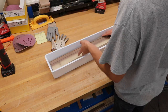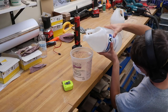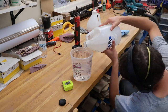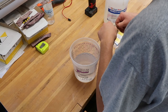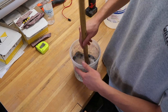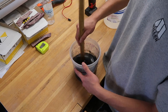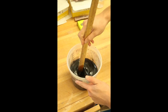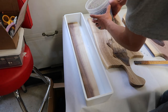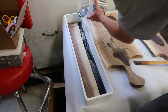I keep flipping the piece of wood around in the mold because I'm trying to see which way looks the best. Next I'm going to pour some epoxy — a two-to-one ratio — put a little bit of black powder in, and mix it up. Personally I just use a little stick cutoff I have laying around the shop and mix by hand, because when I'm done I just throw the stick out. There are attachments that go in drills, but personally they're not my favorite — you have to clean them off every time, which I find to be a pain.